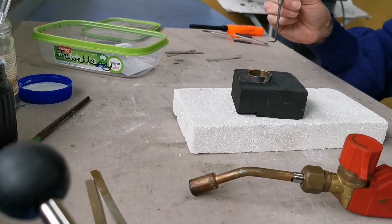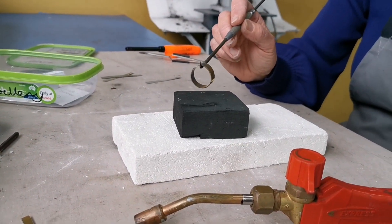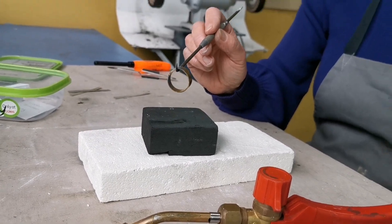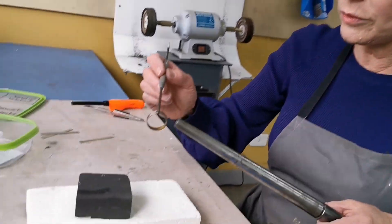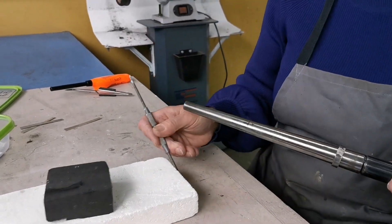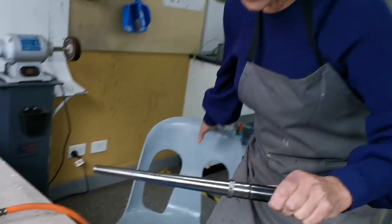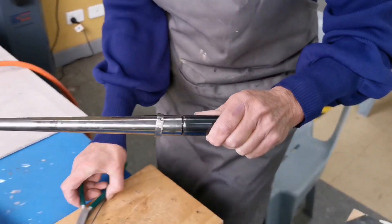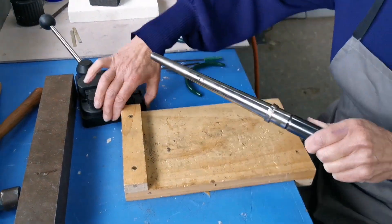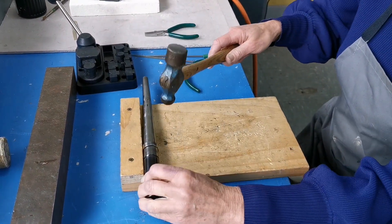That's quite hot but it's also annealed, which is fantastic because that means I can put it onto a ring mandrel and shape it pretty quickly. I'll put it on — it's quite safe to do this. I like to use this on a wooden board, so I'll just move some of this equipment to the side and tap that gradually to make it more circular.